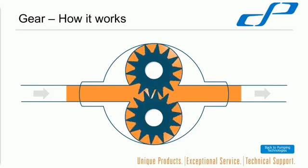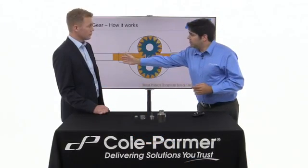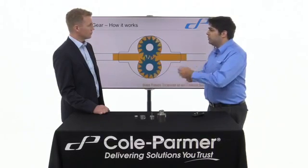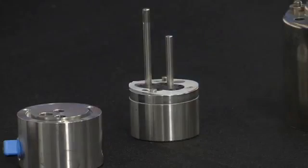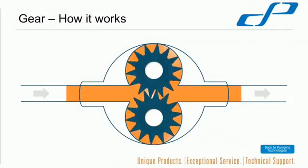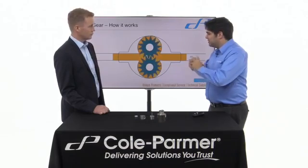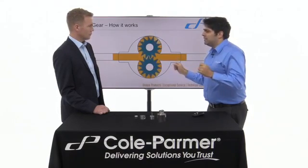We have had customers put a filter at the inlet to stop particulates going through to the pump, which blocks all particulates and keeps just liquid moving. However, what can happen — and has happened — is that customers forget to replace their filters. Over time the filters start getting blocked, restricting flow at the inlet. The pump tries to suck liquid through but isn't getting enough, so it generates a high vacuum and can actually vaporise the liquid. If you've got water, for example, it vaporises to create bubbles. These bubbles are very problematic when they come back around — they compress and generate a tiny explosion that can rip pieces out of your gears. This is known as cavitation.